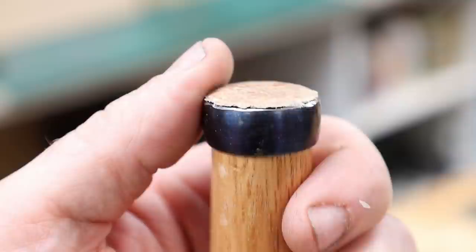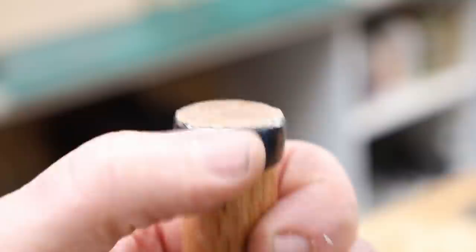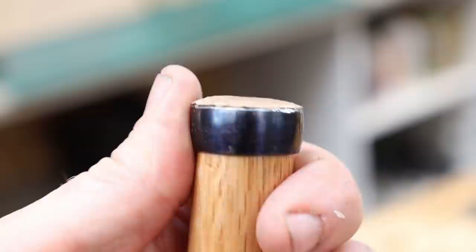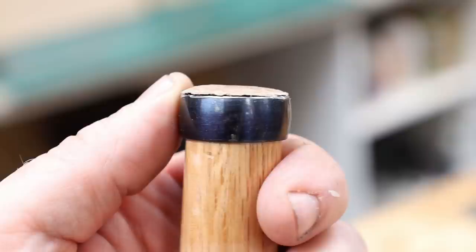Here's a quick close-up — I'm working from the center and striking out towards the edge. I don't want to whack down on the edge because you could split off those fibers. The idea is to hit down and then out. That's what we're aiming for — folding those fibers over the end of the hoop to keep it in place. We've mushroomed the top so we have a nice striking face. Now let's prepare the blade.